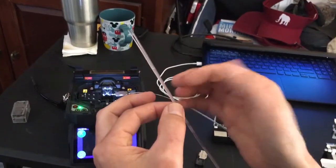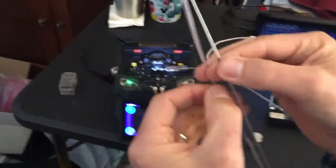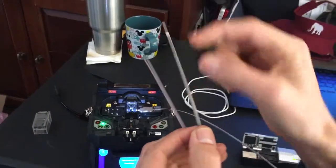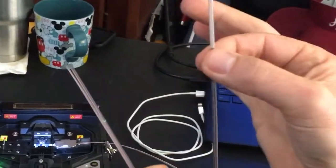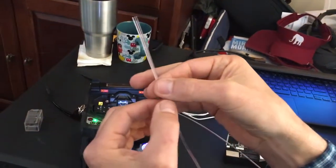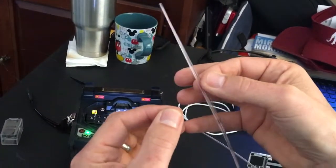You can see it's a ribbon, but the difference is with a regular ribbon the glue — called matrix — is on 100% of the fiber, so you can't pull those fibers apart without de-ribbonizing them. This rollable ribbon is still 12 fibers, but they are side-joined rather than fully bonded.